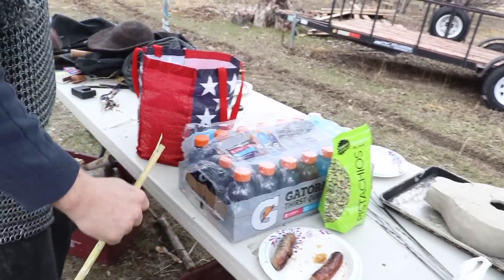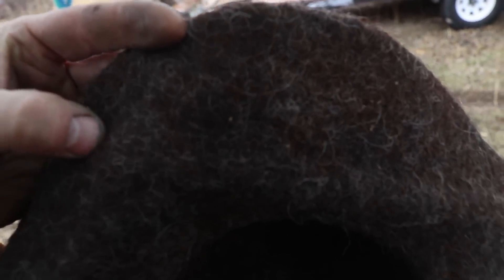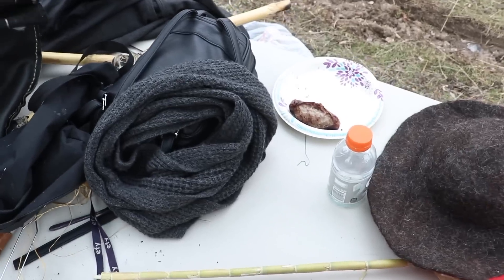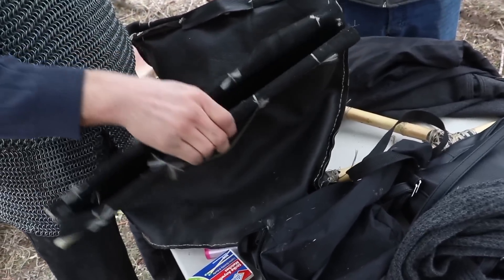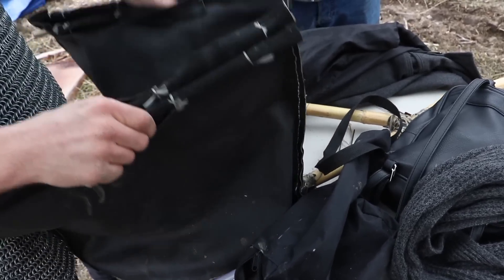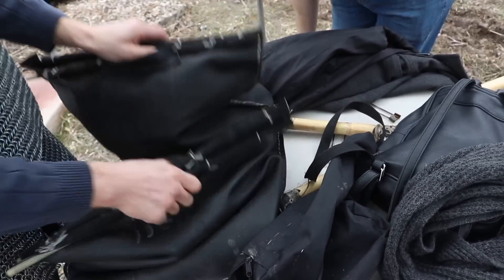Method two of blowing the air is bag bellows, which are right here. These are our bag bellows — they alternate. On the upstroke, you yourself are the valve: you open it and then close it to shove the air through. And then by getting a sequence, you're able to pump air through continuously.